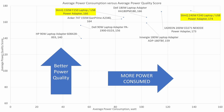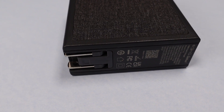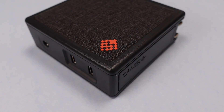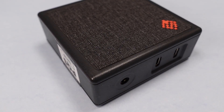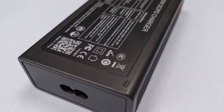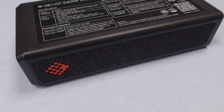This one wasn't much of a surprise. The 150-watt adapter is a skip — the port sharing is nice, but there are better options out there already. I'd like to see this adapter with a safety listing and a DOE 6 mark, but the adapter likely has reasons why it can't meet either of these criteria. The UKCA mark on the device with an unfused UK plug is a bit concerning, and the cheaping out on the mains lead is also concerning. The voltage as a USB adapter isn't amazing, so this fails some of the basic criteria of a power adapter. Does it work? Yes. The 240-watt adapter is a little more compelling — at least it wins at something. The PQS is high on this device, but it still has the cheap power cord and the DC voltage is not great. The adapter lacks a safety listing and efficiency marks, but has some of the better power sharing technology in power adapters. This is a solid maybe.